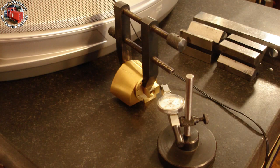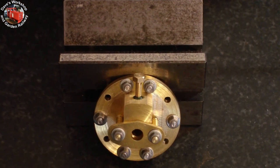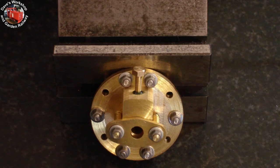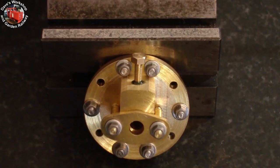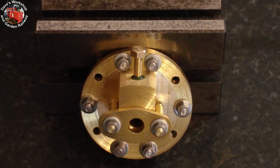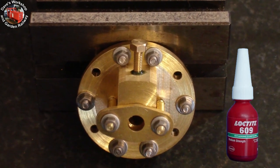Clocking up the base to make sure it's in the right position before I drill through into the cylinder block. I decided to plug the original slide bar bolt hole and redo it closer to the front, as it would be difficult to access. So I plugged it with a brass screw, loctited it in place, and trimmed it off.